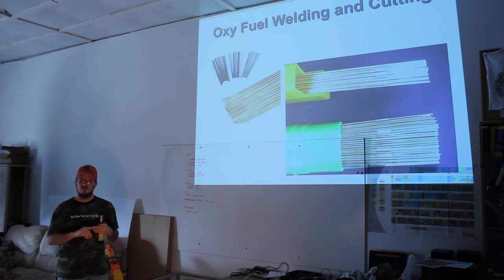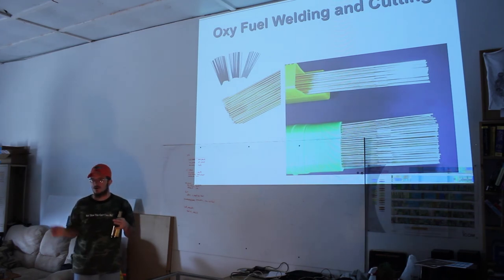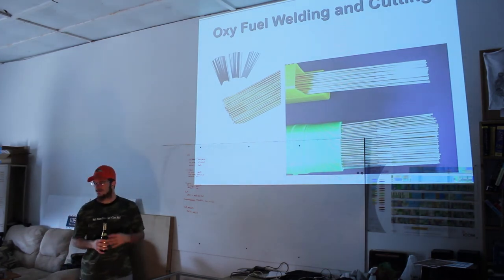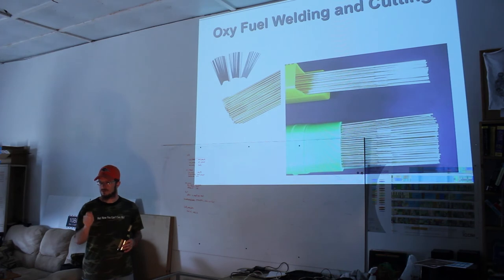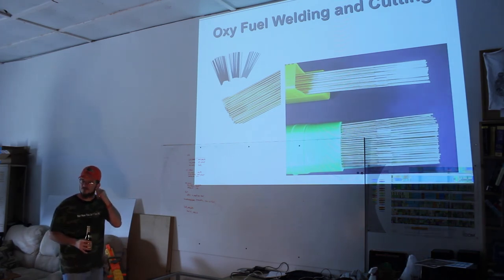Gotcha. The reason why you need filler rod is because you have drip, and some of it gets blown away, that's what the sparks become. Sometimes you're filling. I've made a lot of cuts that were short, and I should actually be embarrassed by them, but no need. I use filler rod. If you weld right, it may as well have not been cut short. I can literally fill it in and make sure it's welded. As long as it's liquefied on all sides, it's going to fill that gap just fine. That's what you need rod for.